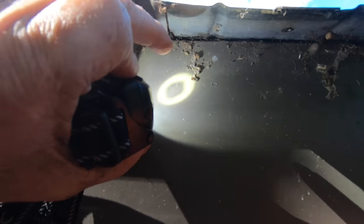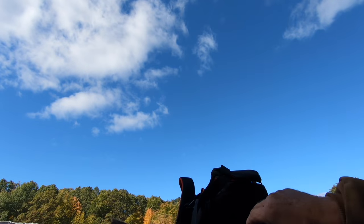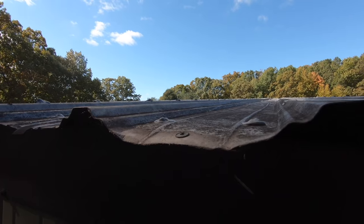Now they took the gutter off, I don't know why. See that debris underneath this edge of the roof — the lip of the roof — you see the debris here. That means debris comes off the roof and it flows back; the water flows back. I think that's what this is — see that — that's an easy fix, that could help a lot.